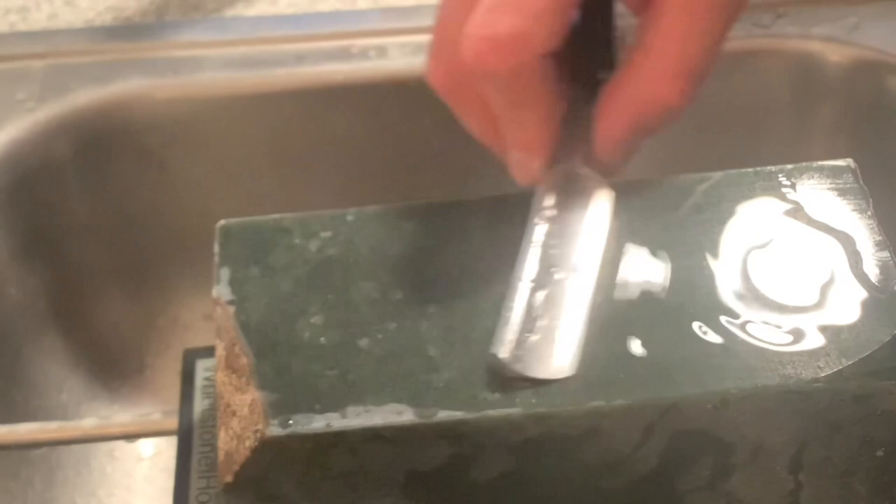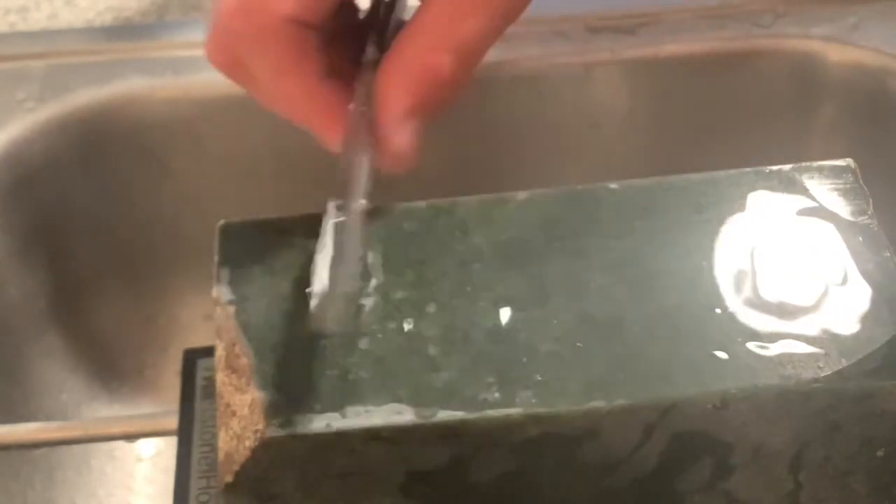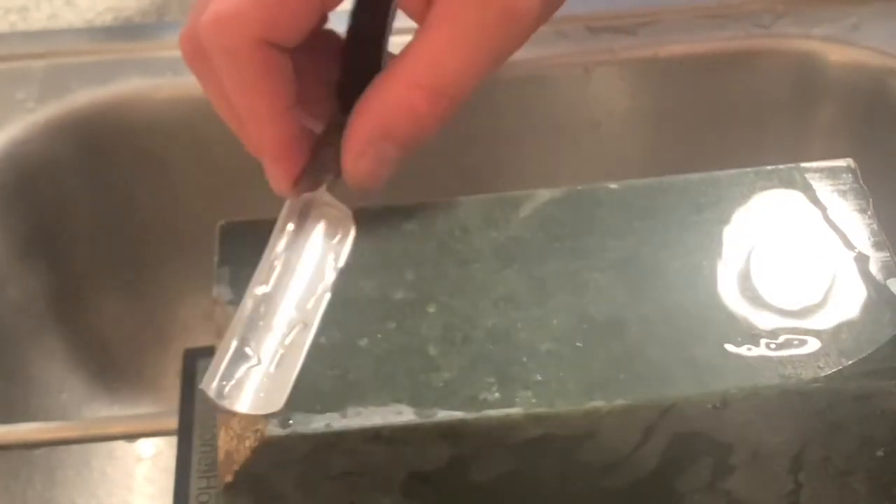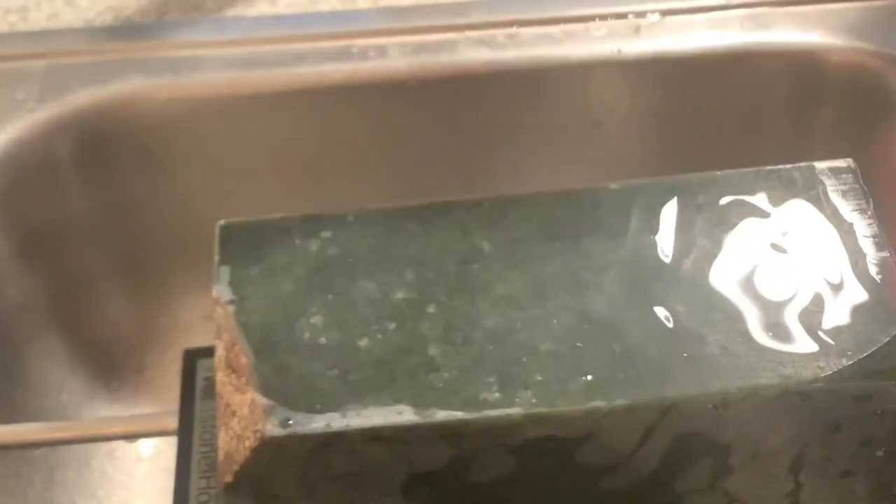That's a pretty fair ballpark because that's about as high of a polish as this stone can take if you buff it with a half micron compound of diamond or chromium oxide. It'll get a really nice mirror shine, kind of like this corner of the stone over here — you can see that it's got that really glassy finish to it.